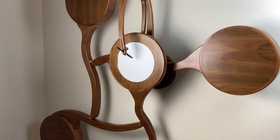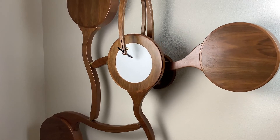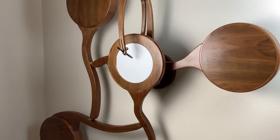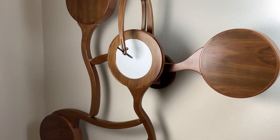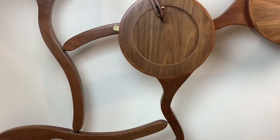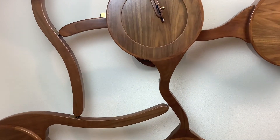This configuration of pendulums was tricky to balance and tune since the pendulums are tightly coupled. Once built, adjustments could only be made inside the weight wheels by changing the amount of weight and the height of the weight. During the design phase, I built a rough prototype to determine the pendulum links, pivot locations, weights, and their heights relative to their pivots. I discovered steel was not dense enough to provide the needed weight, so lead was used for some of the weights. Most of the space in the first vertical pendulum weight wheel was needed to hold the necessary weight, so not much vertical adjustment was possible. There was more adjustment room in the other weight wheels. Based on my previous experiences, I wanted the periods of the first two pendulums to be twice as long as the periods of the last two pendulums.